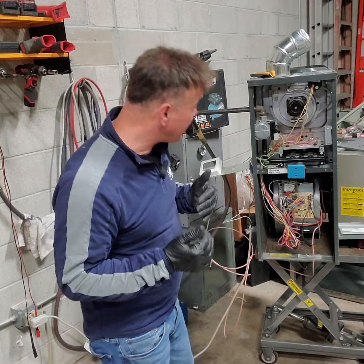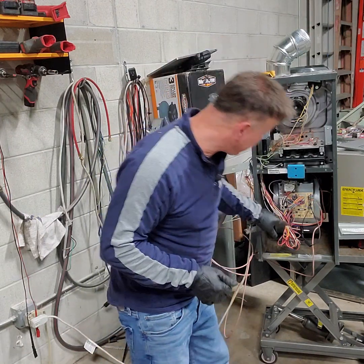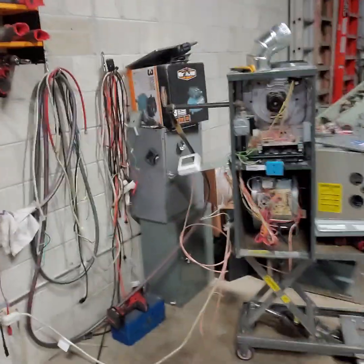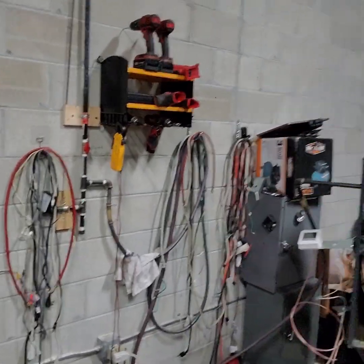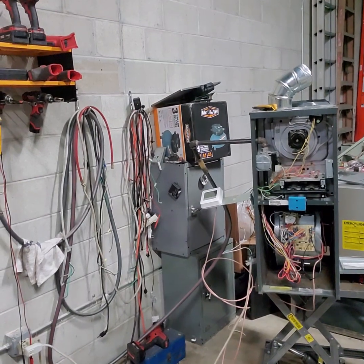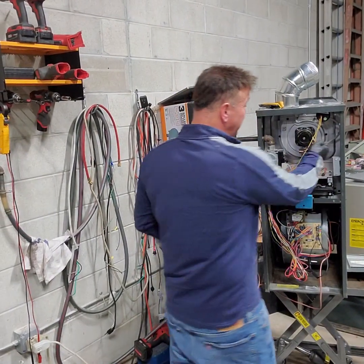And then also, see, you're going to have the 3 flashes. Let me show it to you if you cannot see it. You see it, right? The 3 flashes, 1, 2, 3. So you see the 3 flashes. That's telling you the pressure switch is not closing. So what you can check basically, as I was telling you earlier, check if the connection is clogged.